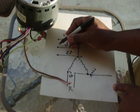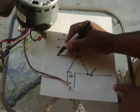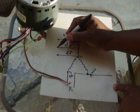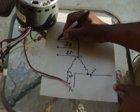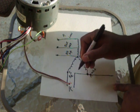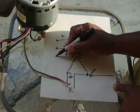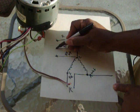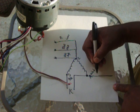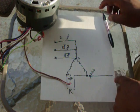You'd pick 1 speed. Don't run 2 speeds at one time, you burn it up. So let's say we want to run at high speed. We cap off the blue, cap off the red, hook up black, hook up white, run your 2 browns to a capacitor. If you wanted to change speeds, cap off black, hook up blue. White stays hooked up.